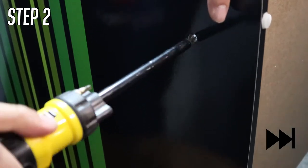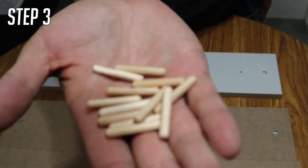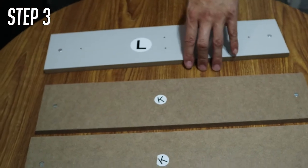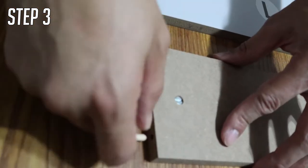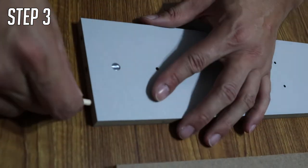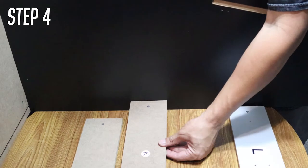Step three is really simple. You're going to need the wooden dowels and pegs, your two K pieces, and your L piece. Put the pegs into each side — on the outside, leaving the middle one empty, as that's going to be for four screws later for your K boards. Do the same for the L piece — on the outside, leaving the middle one empty for screws — then repeat that on the other side.